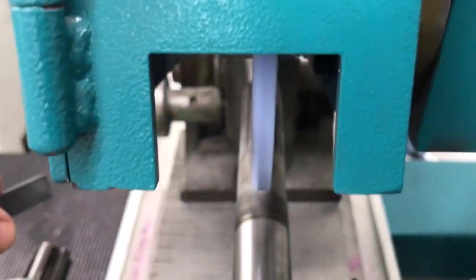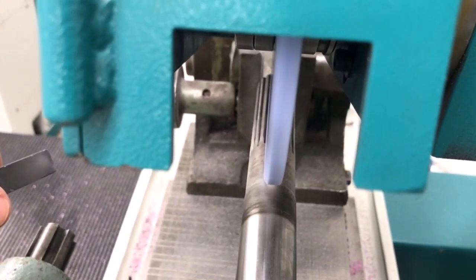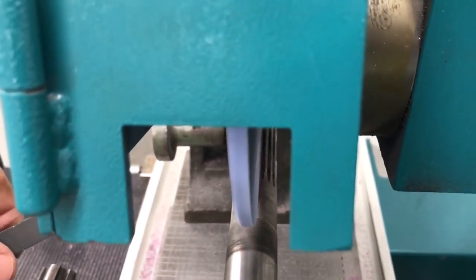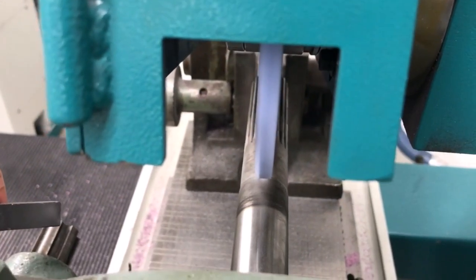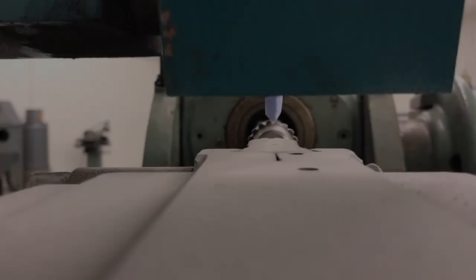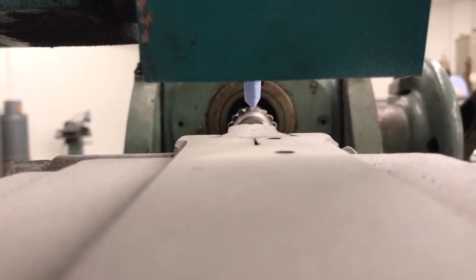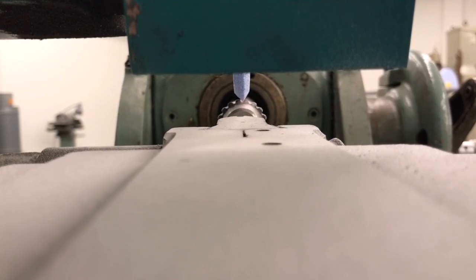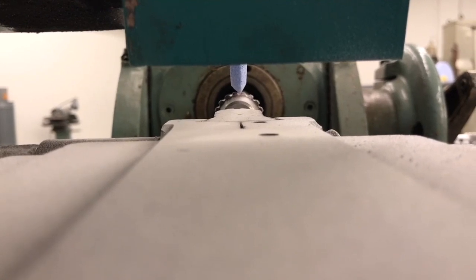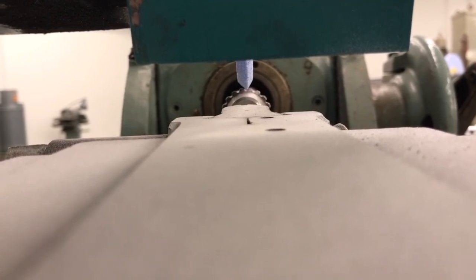Okay, I've got to start on one side here. You can see the start of the angle on that one side. I'll do the same thing on the other side and take this a little bit further. I'm going to do most of that off camera, so I'll just keep working this until I get it closer to a point — not maybe a pure point, but close to a point. Now I have this roughly lined up to center, with a roughly 45-degree angle on both sides. I know it's not perfect; the crush dressing is going to take care of the rest. I just want to clearance away material so the crush dressing will work.